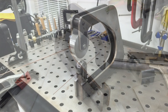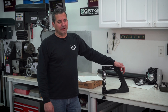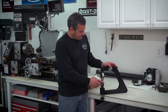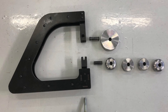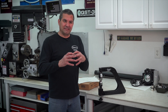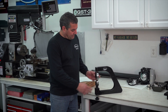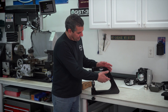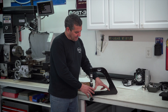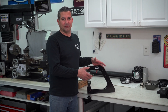All of my designs have iterations — call them mistakes, call them development, design changes — but yeah, a lot. Mainly in the anvils, trying to figure out the best shapes to put in here that really form metal in those small areas. Working a small piece of metal you'd think would be real easy, but it's not — it's tight and constrained. And in the frame, we wanted to have as much throat as we could in here, but the larger the throat, the more flex you have on the legs and extensions. So we had to find that happy medium — the best design with the most rigidity.